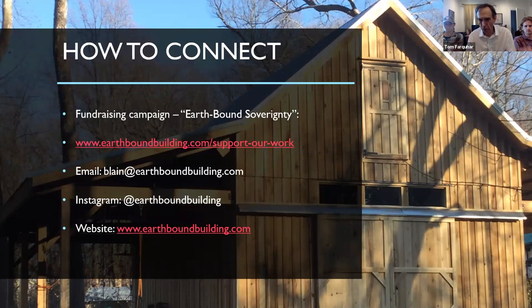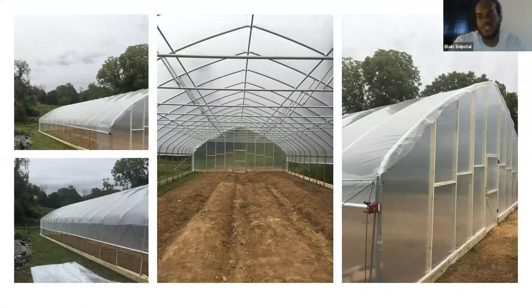But you had a single track on the hip wall. Would you need double track in order to do the two layers? Yeah. So in Nolt's case, for their hip tracking they now only do double track pieces. They only will give you single track for your gable ends if you're not doing polycarbonate. So you could always do two layers added as an addendum if you wanted to. But it looked like your gable ends were just on the wood anyhow, stapled everywhere, even the baseboard just stapled in. Yeah, because this one was single layer.